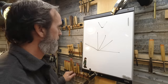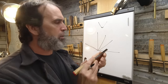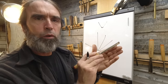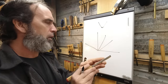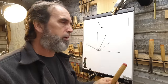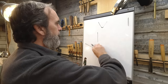A V tool is also called a parting tool, but it's not just for parting. Over time you'll learn to use the sides of the V tool to get into little corners and cracks. In effect, you have a small number one on each side of your V tool, so it can be used for many different things.